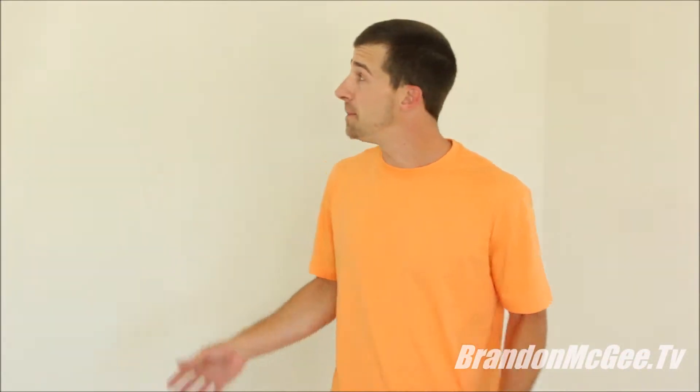So where's the best place to start on your paint job? I recommend that you start cutting in your ceiling first — that makes it easy. When I say cutting in, I mean you want to picture-frame your wall out so you can get all the hard details out of the way, and then just get your roller and go to town. So let's start with the ceiling.